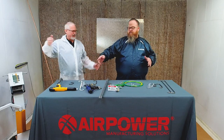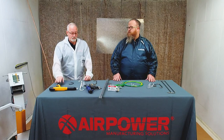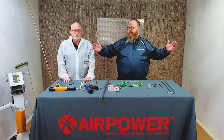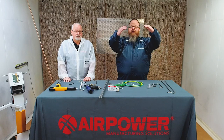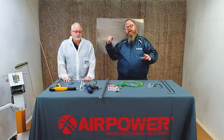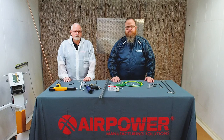Extensions are available up to 6 feet. Powder gun, I'm not sure. Are there extensions for this? So there's extensions for E-stats too. No. Only powder. All right, so for the powder guns, you've got extensions that'll come out, 30 to 50? Oh, you can go to 6 feet. Yeah, and so if you've got big, if you're shooting pipe of some kind, you really have to get up in to get a full coating and an even coating through. Hard to reach areas are fantastic for those.